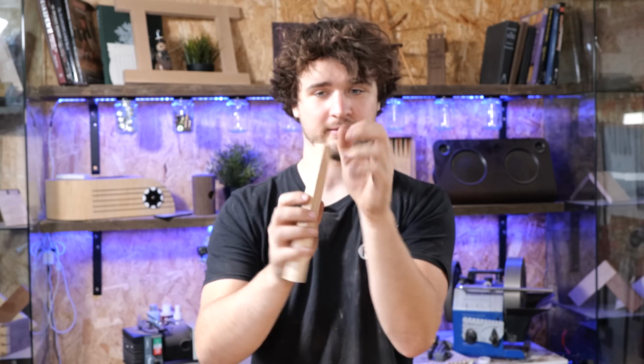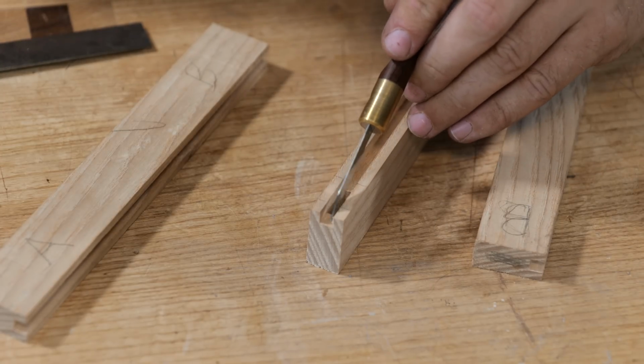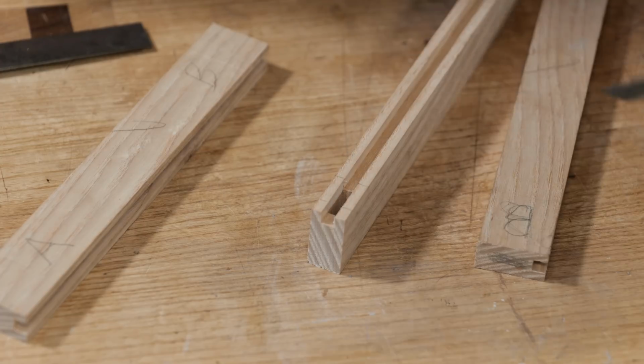And so now we've got the line squared across the top for the haunch, and we've got the 2 over the top of the tenon to account for the width. Now we've just got to do the 7mm down from the top to account for the height of the haunch. And just to make sure I was clear on that, the 7mm is to account for this bit of material here, to ensure that the tenon is able to step over that and then down into the mortise.